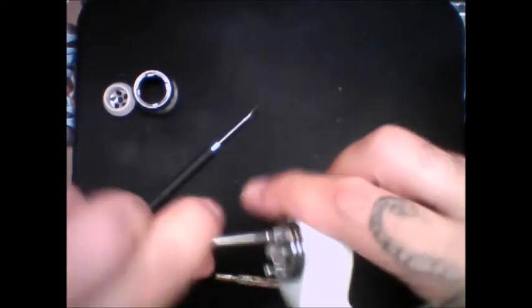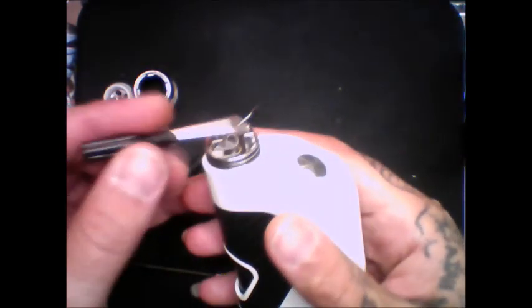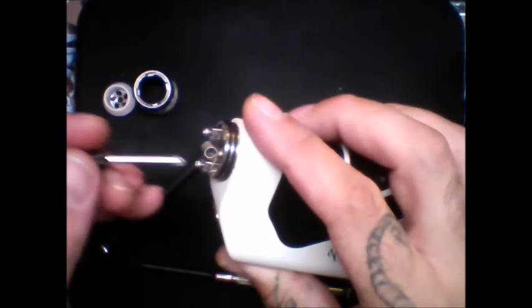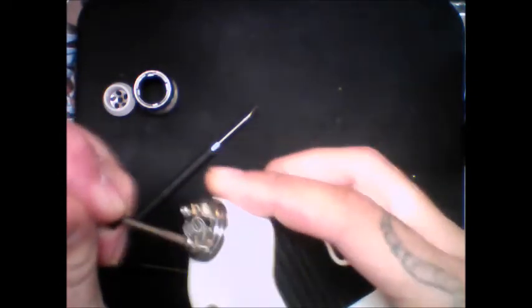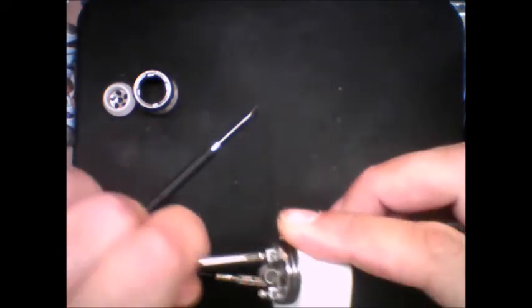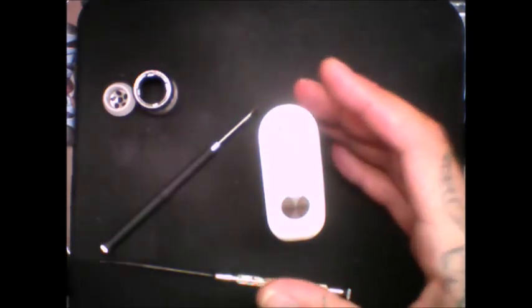You don't want to go super hard because these leads are just soft metal, and these screws are not a super strong metal, but they're good enough where you just clamp it nice and snugged on top. It should work perfectly fine. So with this little screwdriver, you can't put a lot of force on it, so you want to make sure it's tight with the screwdriver, because if you had a bigger screwdriver, it would be easier, so it would be snug. So let's not confuse you guys.